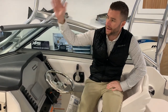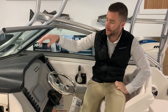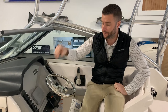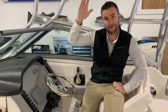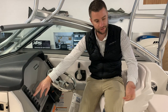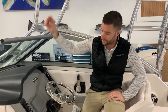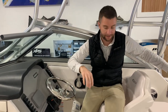Next is your nav and accessory light. You have a nav light forward and on the hard top. You could just turn the mast light on if you're anchored, or if you turn your navigation light on it'll turn the bow light on and the hard top. You have courtesy lights throughout the boat, so in the evenings you could turn those on to see while washing the boat. You have map lights, which are the overhead lights here, and spreader lights in the hard top that face back to illuminate the deck.